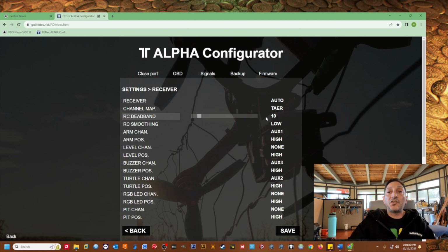One thing I did change in here was the RC deadband. It was 0 by default. I set it to 10. And RC smoothing set to low. You can see I have my channels mapped for arm, buzzer, and turtle mode. And that's all I use.